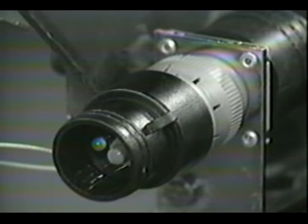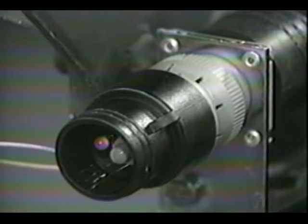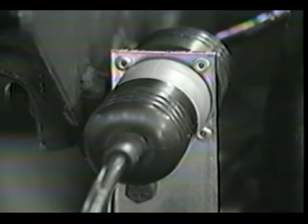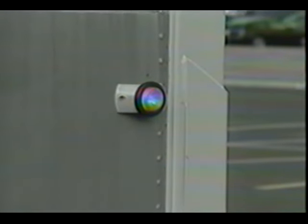It has a molded ECU connector on one end and a molded SAE J1587 diagnostic connector on the other end. The diagnostic cable may be equipped with a diagnostic blink code tool. This tool is used to access diagnostic blink codes and to reconfigure the system. The tool is removable so that a ProLink 9000 diagnostic tool can be connected in its place. Also part of the Easy Stop system is the ABS warning lamp, which is mounted on the outside of the trailer. The lamp comes on if there is an ABS malfunction and can also be used to blink out fault codes.